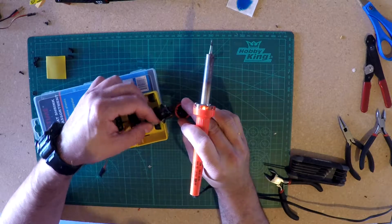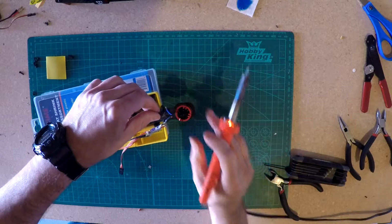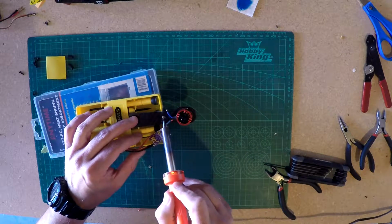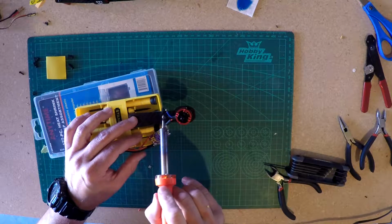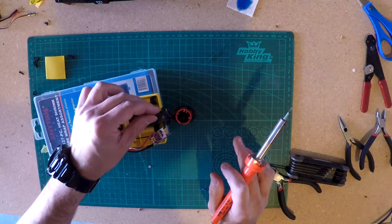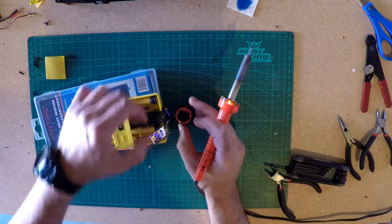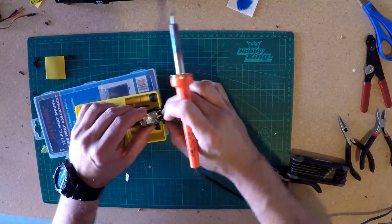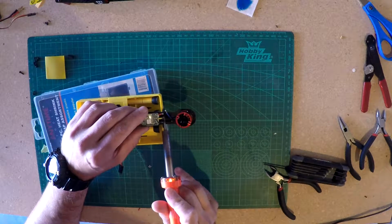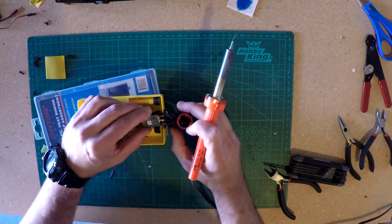Oh, see, I forgot my heat shrink there. Someone should have told me there. Speak up, guys. Boy, that is a ragged bit of solder on there. Let's see if we can make it a little better. This heat shrink will shrink when it hits the hot soldering section. I've done that before too, where I slide that on too soon after tinning, and immediately the heat shrink is heat shrunk, and that melted together nicely.